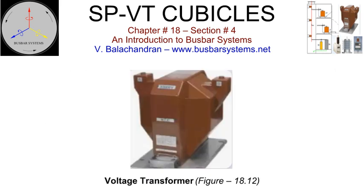Voltage transformers. It is the norm to use dry-type, cast resin voltage transformers in the cubicles. The thermal insulation of Class B should be adequate. A few specifications call for fuses to be incorporated on the high-voltage side of the voltage transformer for protection. For large generators, the rupturing capacity can be so high that fuses for the specified prospective fault current ratings are not in the range of manufacture.